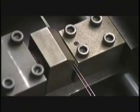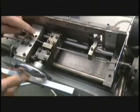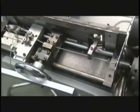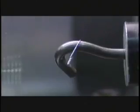The wire now undergoes a twist test to check the ductility of the material on our torsion tester. Wire is looped onto a hook, clamped on a metal block, and rapidly spun, twisting the core wire until it breaks. Only wire that passes all of these stringent tests will be used to make finished strings.